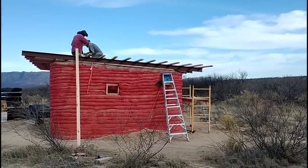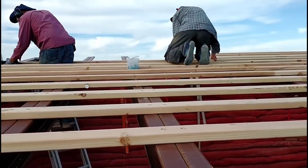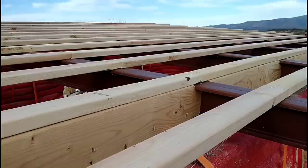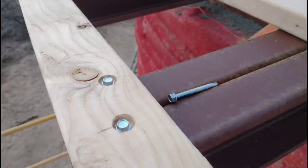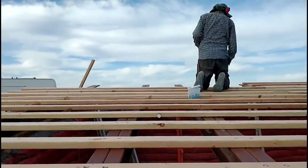While I've been prepping the boards, Kyle has been up on the roof installing them. We're using two screws wherever they cross the beams — two screws into each beam for each purlin. We also made sure that one of the rows of purlins is directly over the top of the block board. This worked out okay with the spacing. On the top side, we had to add an extra row just to make sure that we had that board directly on top of the block board in order to seal the roof.